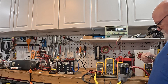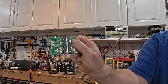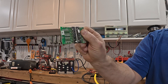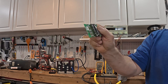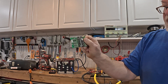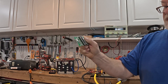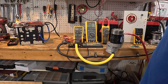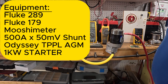Anyway, that's what can happen — you can kill your BMS. The reason is pretty simple: these little black squares on that circuit board are called FETs, or MOSFETs. Those are the switches that enable the charging or discharging. All that current from your starter motor or windlass has to go through those FETs. This is a very tiny 100-amp BMS from a very early Amazon battery. Today they're bigger, but if it says don't start your engine with it — don't do it.